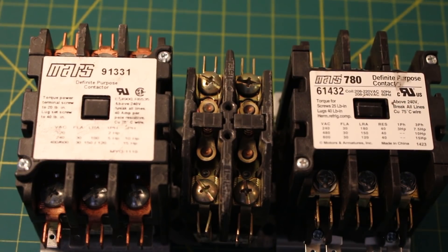So what is a contactor? In simple terms, a contactor is a device for making and breaking a circuit, similar to a relay. A contactor is typically controlled by a circuit which has a much lower power level than the switch circuit. An example of that would be a 24 volt coil electromagnet controlling a 208-230 volt circuit.